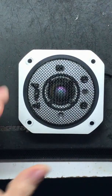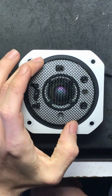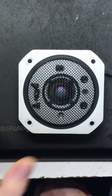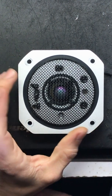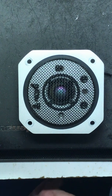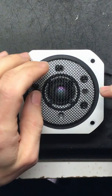Today we're going to repair one of these tweeters found in the Yamaha NS1000 series speakers. These are beryllium tweeters and the Yamaha NS1000 is one of the best speakers ever designed, so these are really worth fixing. They are becoming extremely expensive even to find second-hand. Unfortunately, these are really sensitive to amplifier clipping — with the slightest clipping you can literally blow the tweeter up.